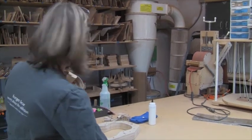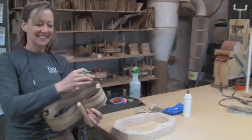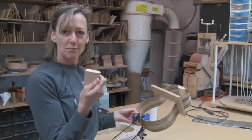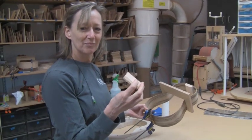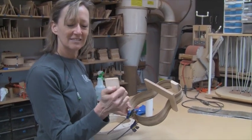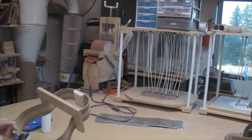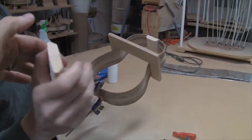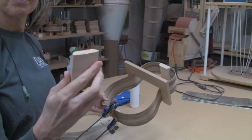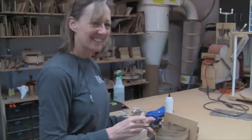So one thing I do — let me say something about that neck... Can you grab that tail block for a minute? Yes, sure. With the radius? Ben didn't show how he makes those, but they're cut square and sanded on the disc sander. He's got a very cool combination vacuum chuck that holds it against the square edge and it rotates so the correct radius — and he just does exactly like that and it sands the radius right on the block.